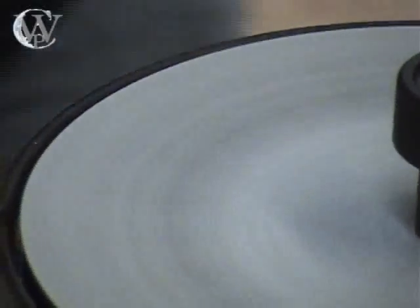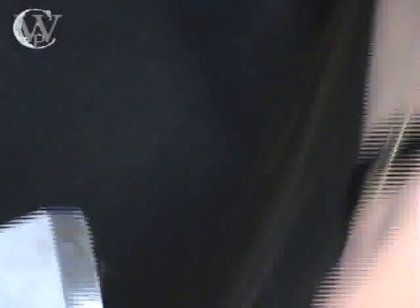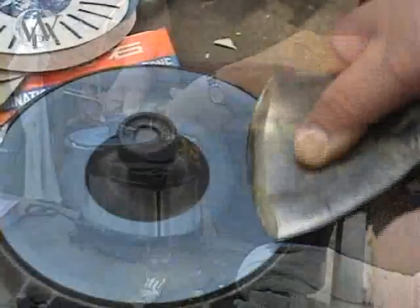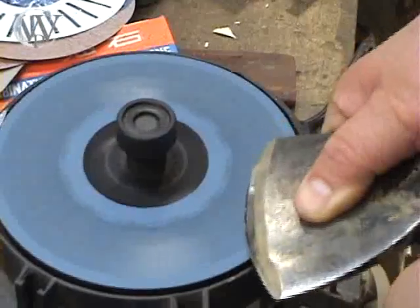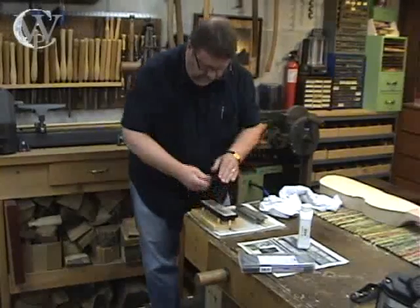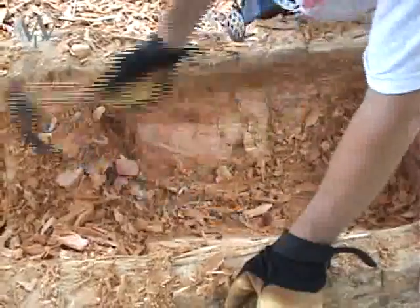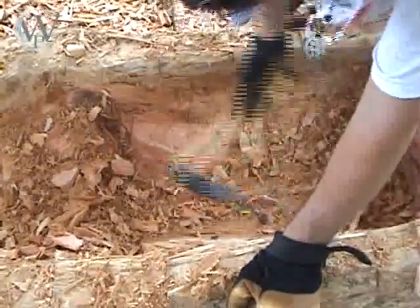I have a feeling for a sharp tool in my thumb. Some people test sharpness by cutting hair on their arm to show it's razor sharp, but you can actually get it sharper than that. With power tools I think I can get an even better edge than with the original hand-driven tools. Using a sharp tool is actually safer than using a dull tool — you have better control over your work and cut. With a dull tool you might force it, causing it to slip, and then you can really hurt yourself.